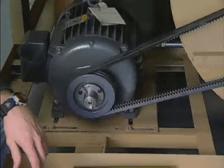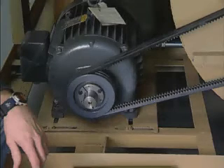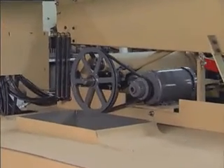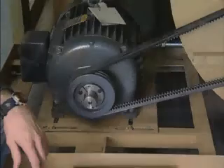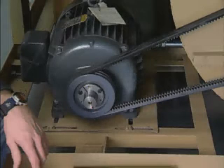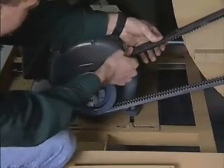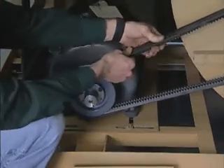There are three sets of belts and sheaves in your Oliver MaxiCap: the main drive belts or fan belts, the variable speed belt from the variable speed motor to the eccentric shaft, and the blender belt from the blender motor to the drive. New belts have a tendency to stretch slightly and should be checked. To check a belt, turn off the machine and lock out the power, then apply pressure to the back of the belt midway between the two pulleys. The belt should deflect one half inch.